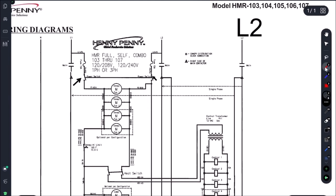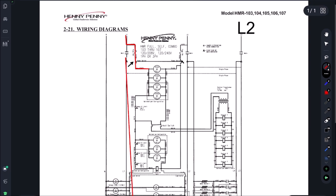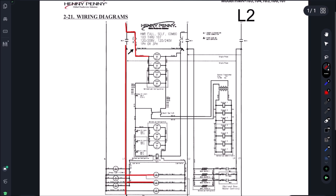Let's go through our sequence quickly. We're coming through here, hitting up our canopy fans, and if we continue down the line we're hitting up all our lighting. All the lighting is in the circuit, then we're hitting up all of our relays for our lower elements. Then our cooling fans in the canopy, and then our blower motors and the contactor coil - that's our L1 side.